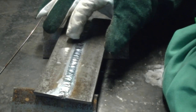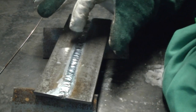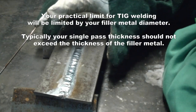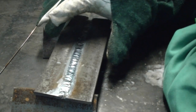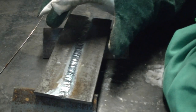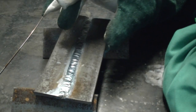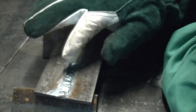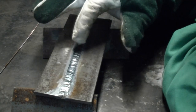You might be asking why we broke this piece of metal up into two passes, or we could have even made three if we wanted to. The reason is it's just not good technical practice to weld a thick, heavy, gobby pass in a single pass. If you've got a piece of two inch thick plate, you might have an all-day or even an all-week task. You get a much better quality, purer weld if you weld in a thinner pass and lay several passes down. We could have just as easily laid in two beads here — we just did this wide bead to show you the capability of the unit.